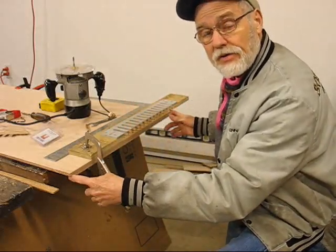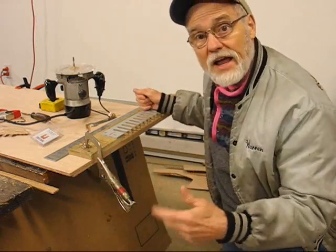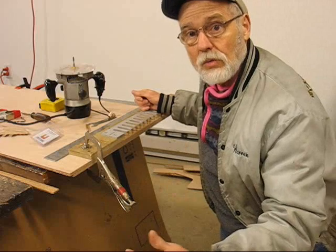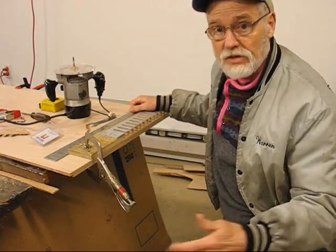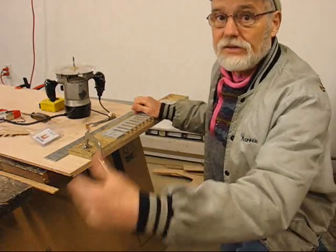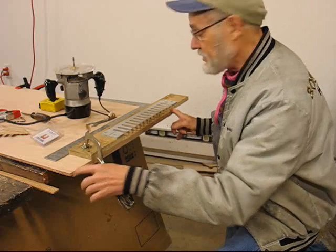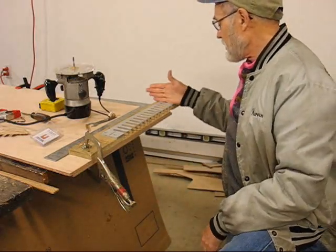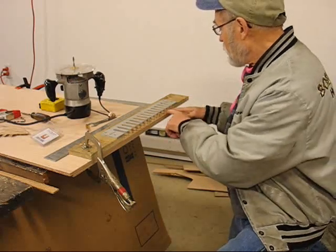I've got a pure 24 inch wide piece, and so that half inch goes into equal things as opposed to a 9/16 or a 7/16, which is going to be all the 16ths you'll be counting and adding. So I've got everything set off on the half an inch, and then the very end of this thing is lined up over that. I'll reset up here for a second to show you what I've got to do.